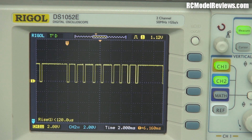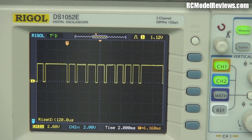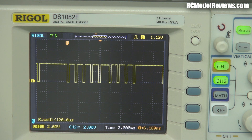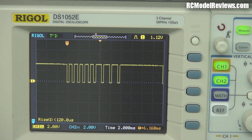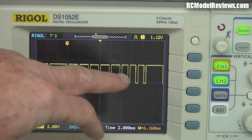If you make one of the other pulses wider, the extra space has to come from somewhere, and it comes from the width of the sync pulse. When I move channel two the second pulse becomes wider and narrower, and the same goes for channel three and channel four. There are also other channels — this one on a switch changes in length too. If we make all the pulses to their minimum length you can see the sync pulse can be really wide, but conversely if we switch everything to the longest length then the sync pulse has now become almost indistinguishable from the other pulses.